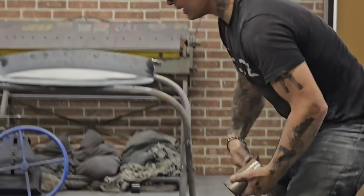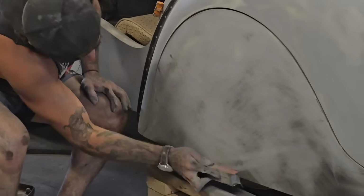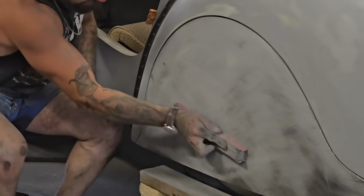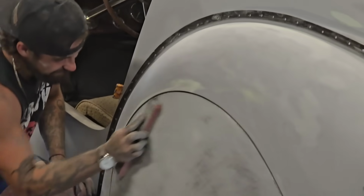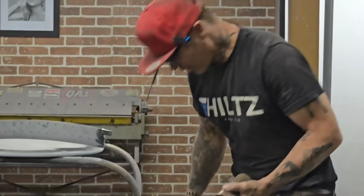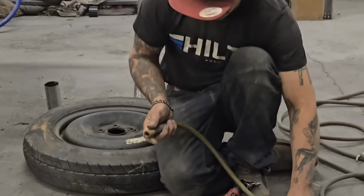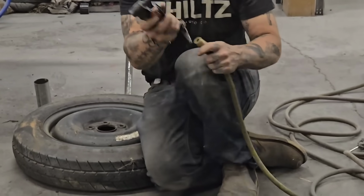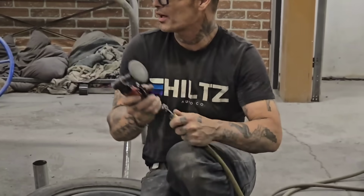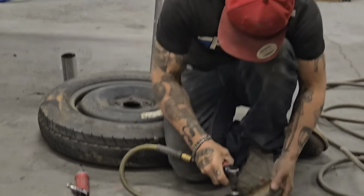I want to clean that again. I want to clean that off. I just took the die grinder, went on the inside, took the burr off it. Let's face it, you can jam her down in there with that burr on it, but I wouldn't want to be the one that got the cut finger from it. If I go to change a tire or something like that, I want to clean that stuff up. We'll just clean the metal so paint will stick to it, or anything will stick to it. If I want to put it in there, I still got to sand that trunk down to take that rust off, same as this.